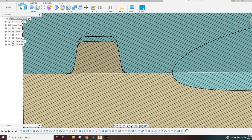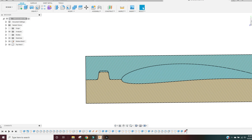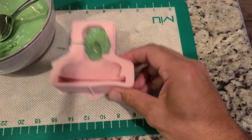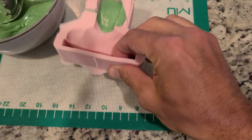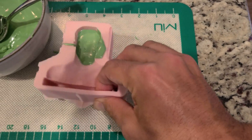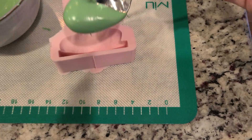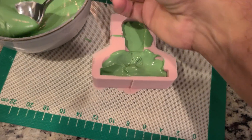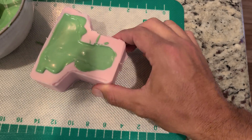When modeling your slot features, make sure there's interference in the model because you're molding a negative — that ensures you can close it all the way on the molded rubber parts. For the candy molds, put just a little bit in the face first and agitate a lot, because bubbles will form around the nose and mouth. If you fill it all the way and try to agitate, you still won't get the bubbles out. Once it's smooth, fill it the rest of the way with a bit more agitation, though this isn't as critical since it's not fine details that will be ruined by bubbles.